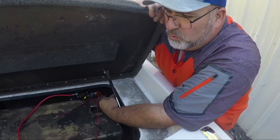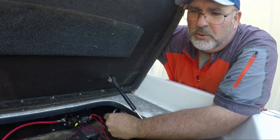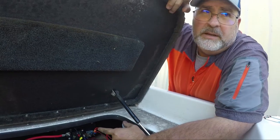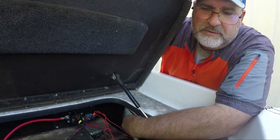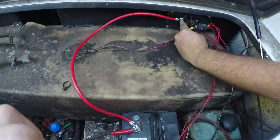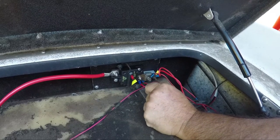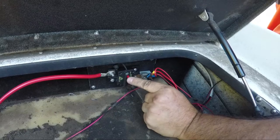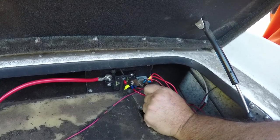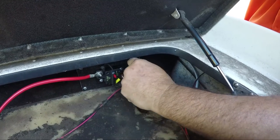When we opened up this old boat, it had absolutely no master power switch whatsoever. What you want to be able to do is stop the power from going from point A to point B when you don't need it. So we took everything on this boat and put it on a master power switch, except for the actual engine. We ran a new drop circuit with good wire from the back all the way to the front, connected to one side of the switch. When the customer gets in in the morning, they turn it on; at the end of the day they turn it off, plug in their boat, and they're charged and ready to go.